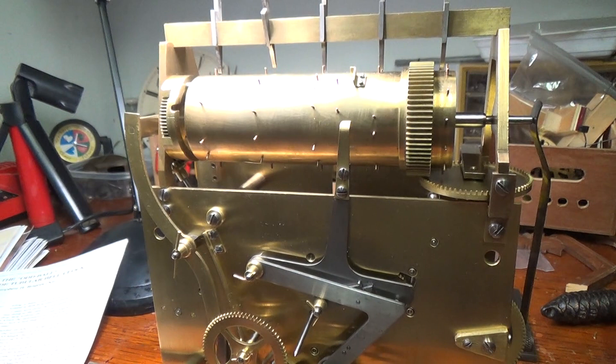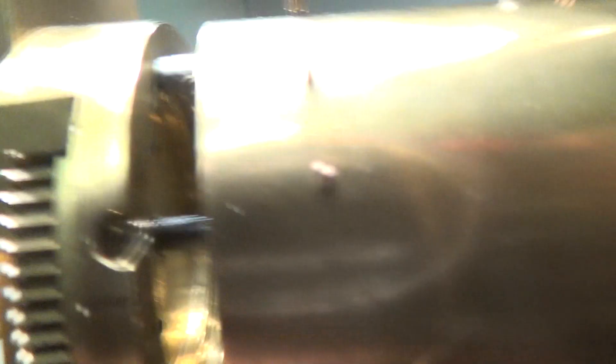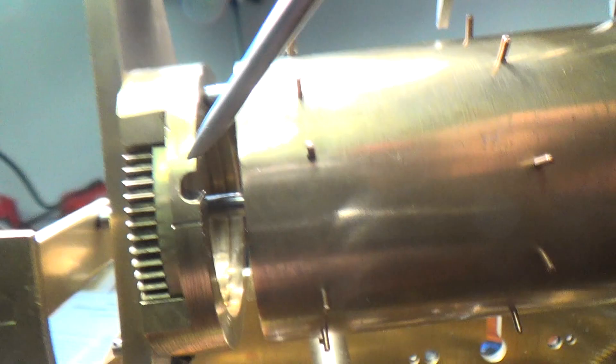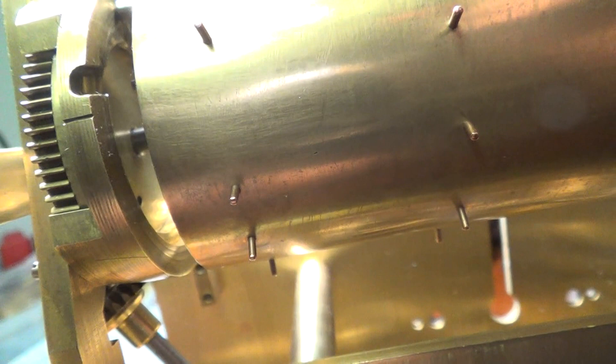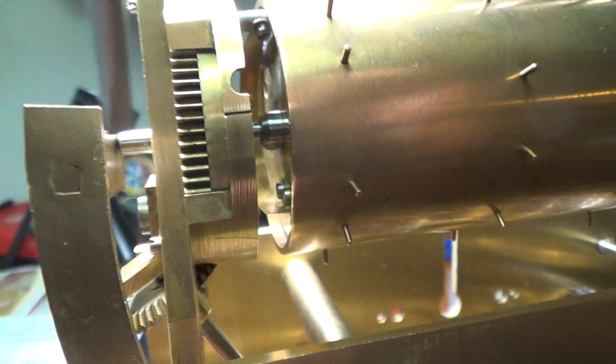The mechanism that rotates inside — what's called the hour track — and the outer mechanism is called the chime track, because that's where the pin rotates once every hour. And the inner thing — the hour track — rotates once every twelve hours. So that's the differences in that mechanism. I hope that makes sense.